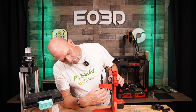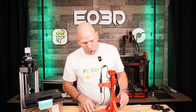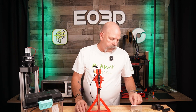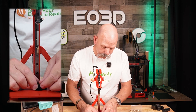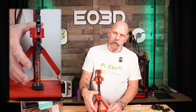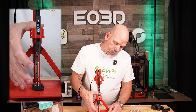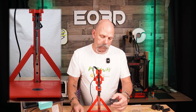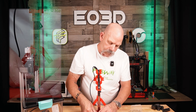Let's bump this up. We don't want to do 330, so let's go to 320 — I don't think 10 degrees is going to make that big a difference. There we're set at 320. Get the heat set in place, bring it down, give it a while to get the brass heat soaked, and apply some pressure. There is a tiny bit of movement, but it really takes a lot of pressure to push it in there. So that's 320.